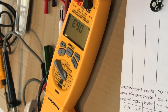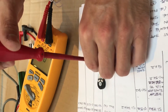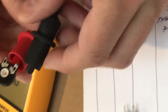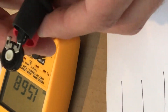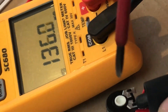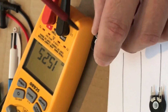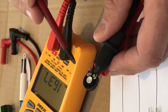So we should have the same thing with the old one, but we know we weren't getting it reliably when all the way over to the left. So I'll put this fully counter-clockwise and see what reading we get between the back pin and the front left — we should get something similar to what we got there. But looking at the meter now, it's registering all over the place. If I push it over to the left and hold it, we're not getting consistent results at all — which is why I'm saying there's something wrong with this variable resistor.